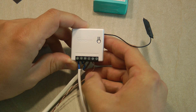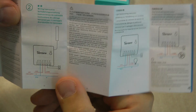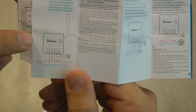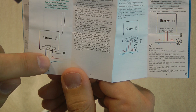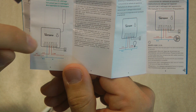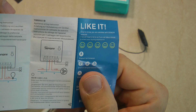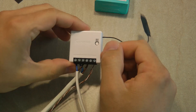The instructions specifically say not to connect S1 and S2 to mains — these are signal-only connections carrying switch signals to and from the Sonoff so it knows the switch position. Connecting mains voltage to S1 or S2 will most likely destroy your Sonoff Mini. The same connection diagram is shown in the documentation. The first four terminals on the left are just like a Sonoff Basic — two in and two out in a different arrangement — and on S1 and S2 you connect your switch.